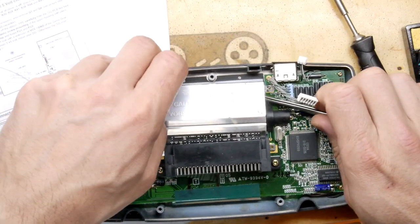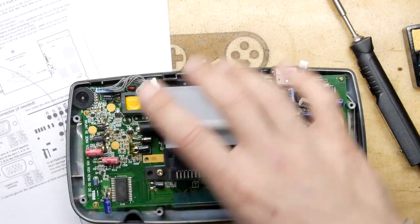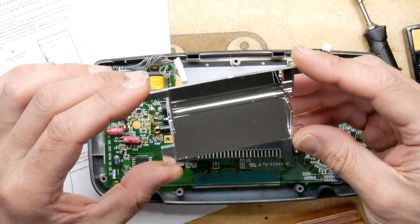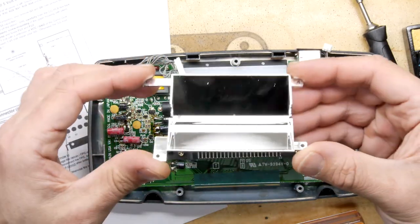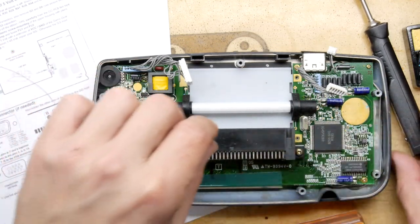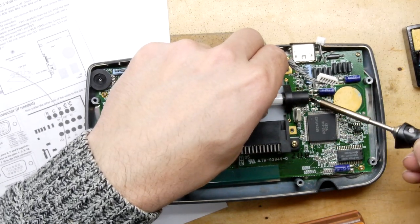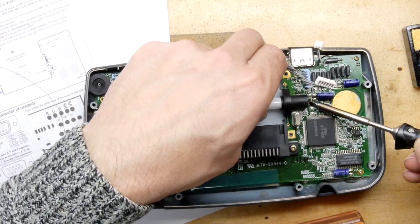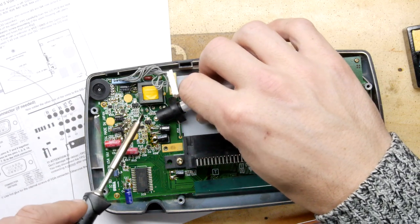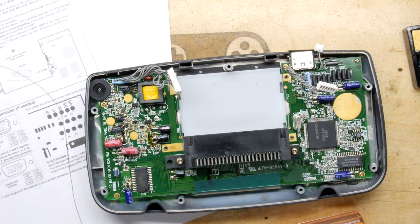Be careful - don't do this with the power on, because this tube probably needs many hundreds of volts to operate. Look at that reflector - it's really amazingly shiny after all this time, considering it's some sort of electroplated plastic. It's really survived well. Let's get this out carefully - there could be mercury in it, and I suspect there probably is mercury in it.